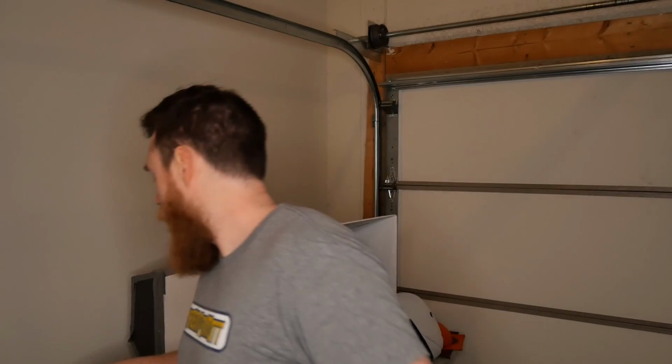However, with resin, it is a little harder than standard PLA or PETG, so I do recommend picking up some sort of electric sander. It doesn't have to be an orbital. The Mouse sanders are super nice as well, but we're gonna start with about an 80 grit sandpaper. Some people do 60 grit, some people do 120, anything between 60 and 120 for that first coat, just to knock down some of that excess resin and start that sanding, smoothing process.